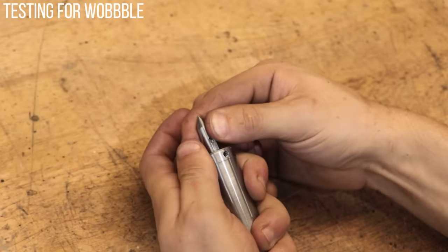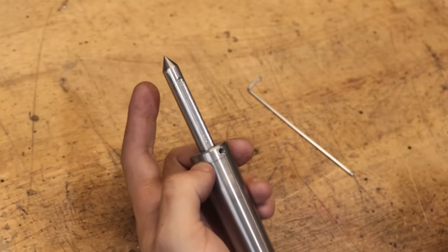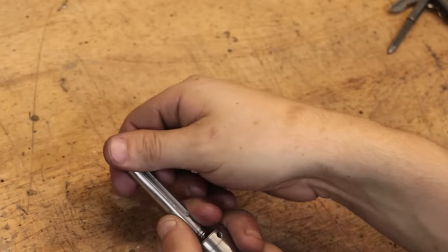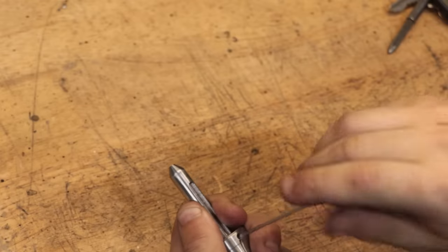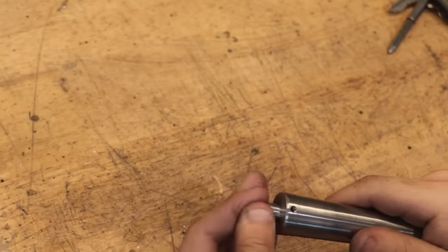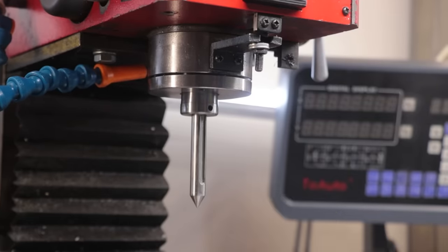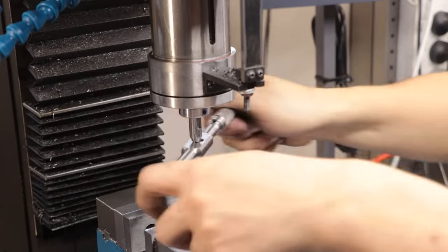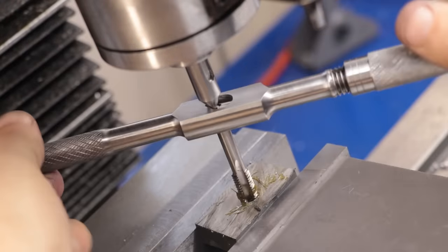That is a pretty good tap follower — there's a nice amount of preload on the center and a lot of travel too. I measured it and it comes out to just under 50 millimetres. It's also very easy to swap out the convex end for the concave end — just undo the grub screw and flip the center. My favourite part is that the mechanism is housed entirely inside the Morse taper, so it doesn't take up a huge amount of vertical space on the milling machine. I didn't end up hardening the tip — I didn't want to risk warping the part, and the silver steel I'm using is high carbon, so it's pretty wear resistant even in its annealed state.